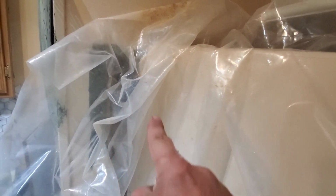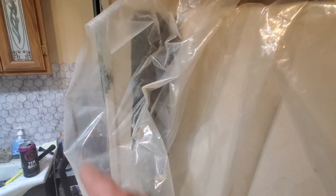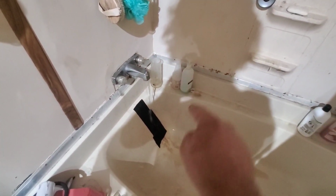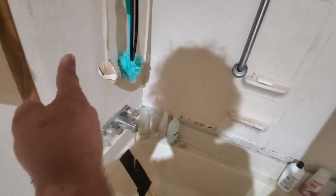But what I've done now is, before I turned my water supply into my hot water tank, which goes to the bottom, and then comes back out the top over here, which you'll see later, and then into my house supply, I went ahead and opened the second closest valve, because my bathroom sink is the first closest. And what I'm doing is I'm pushing air out of the tank. So as the water comes in to the bottom of the tank, all the air is forced out of the supply line that goes to the house.